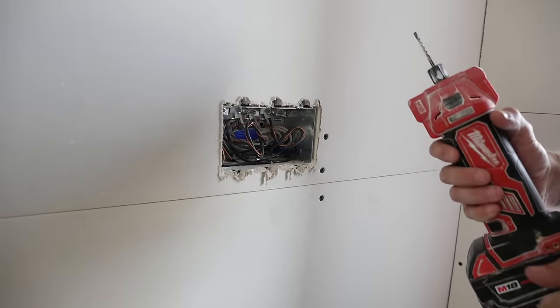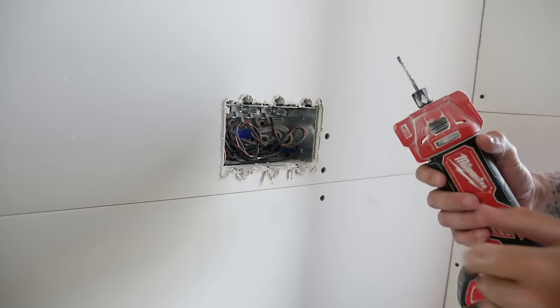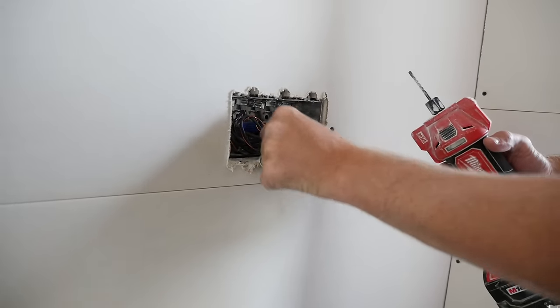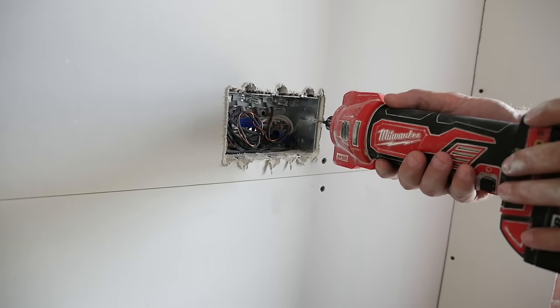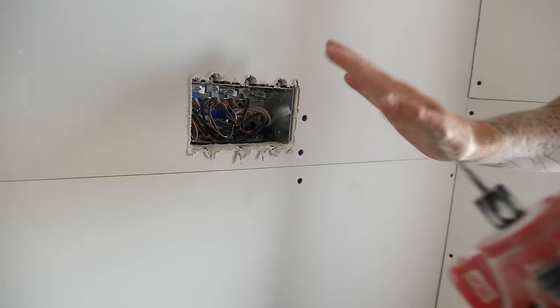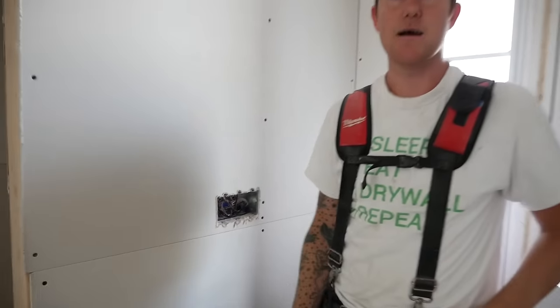But that being said, a lot of electricians nowadays push their wires back before we come. They expect we're gonna be using them. But say a wire is out a little bit like this, you see it, just take the 2 seconds, shove it in a little bit deeper, and take note of that when you go to poke in your router. Just aim for somewhere you know the wires aren't gonna be, poke in here, hit the side, and go around. That way it keeps everybody happy, it doesn't take any time at all, and you're not gonna be a jerk.